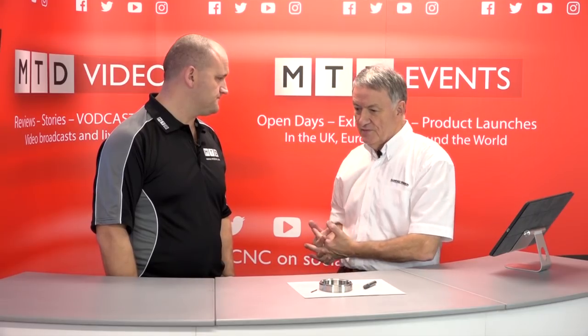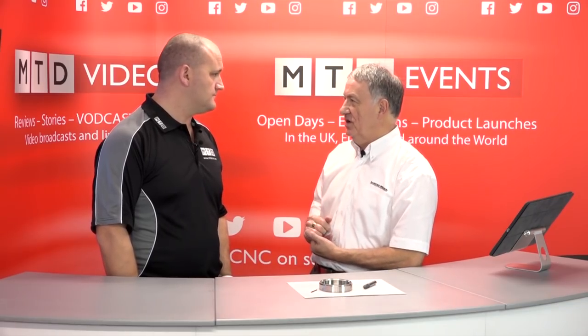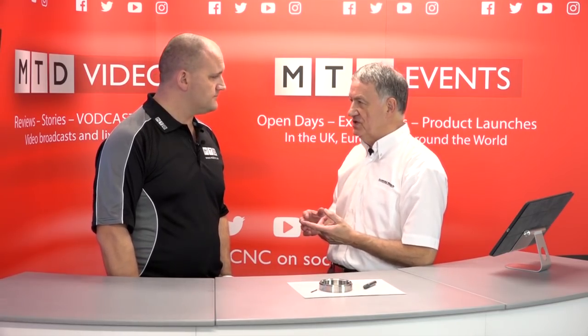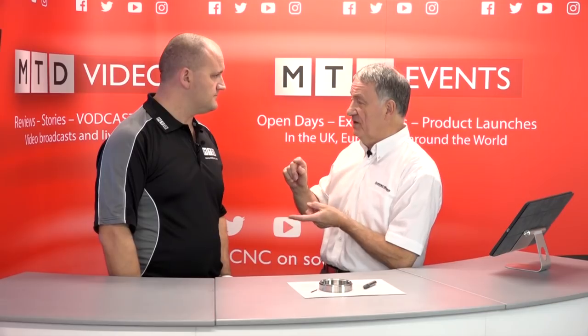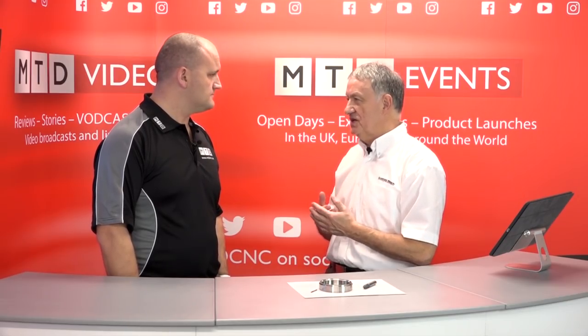I know they've got a new website — Union Tool. An interesting development for the technology side of our company is that we've always had feeds and speeds in our manuals, but this is a new feature where the website gives you feeds and speeds for all materials with tools being held very rigidly — fairly short — medium length, and very long length where they are not the most rigid. You can see how the cutting parameters change for each particular application and each material. It also includes the tool holders, type of machine, and the coolant being used.